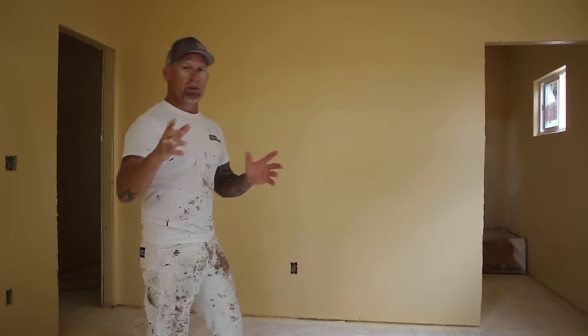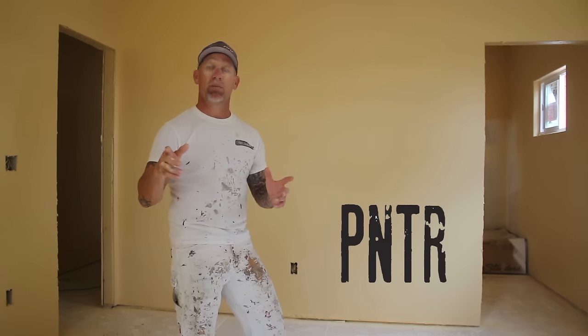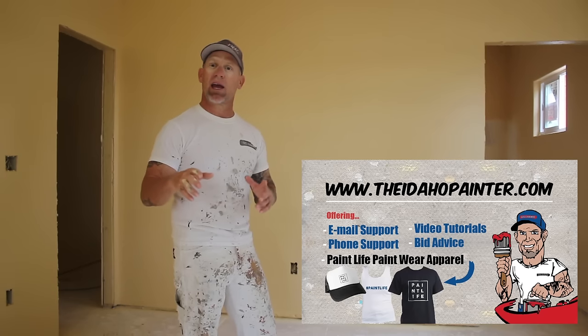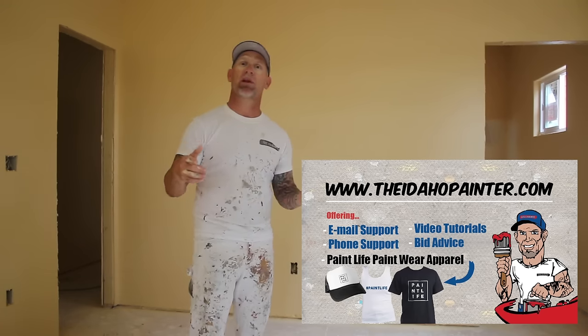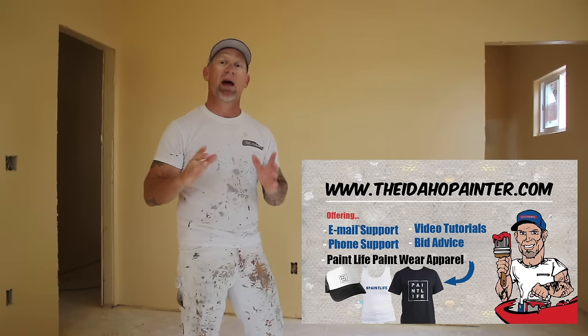Also, here's another simple tip when you're spraying. I'm using a 30-inch extension, and the reason why I use that extension is so I can reach the ceilings and reach the floors without having to get on a ladder, without having to bend over. But along with that extension comes the gun spinning, and you'll see me spraying, and that's why I'm typically in a bedroom. I'm only releasing the trigger just a couple times. I'm trying never to release that trigger going up and down spraying, and it's gonna be a lot faster to spray without releasing the trigger, but you're not going to get spits in areas that you don't want to get them, because with a 30-inch extension you're going to get a pretty large spit, and you don't want to get spits in the middle of the wall. So when you're working around windows and stuff, you're trying to spray it without releasing your trigger so you don't get any spits.